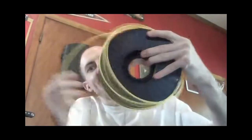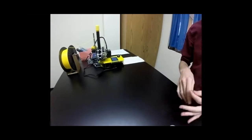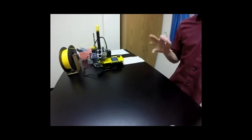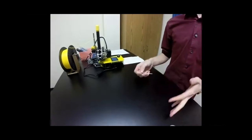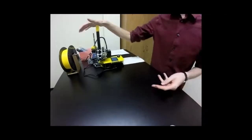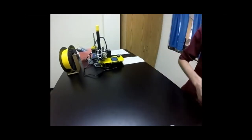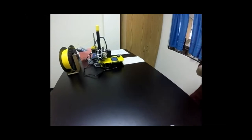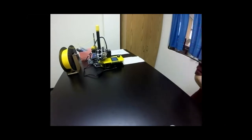We covered the design process, and now we're going to use an STL file generated from objects created in that design space. The next part is slicing — using a slicer to create G-code, which the printer runs off. That's the step where we go through Cura. You have version 15.04.06 installed, so we'll jump into that.